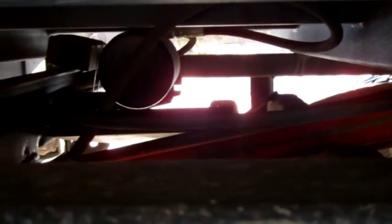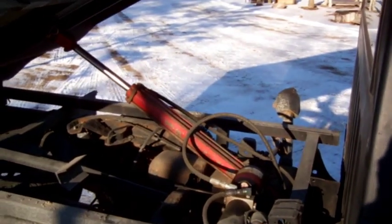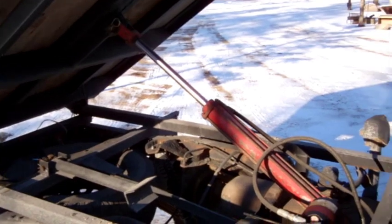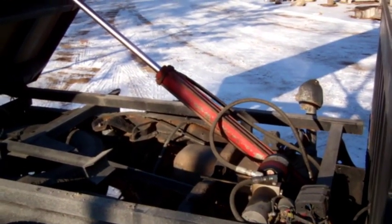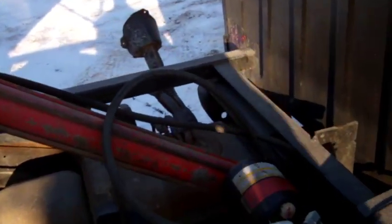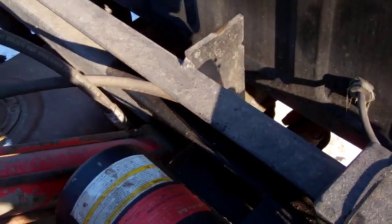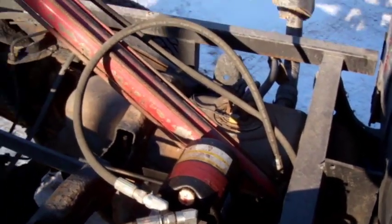This gives you an idea of the angle — the camera is about flat, and that's about the angle on my ram. It's just basic trigonometry to figure that out. With a 2-inch ram, if you want to lift more you could make the angle as steep as possible, but then you start sacrificing the dump angle when the bed is open. I didn't go with the scissor-style lift. I did a lot of looking into it, and I figured for this quarter-ton truck I have plenty of force with just the single ram — a lot less moving parts, very simple. For a small application like this, there's nothing really wrong with it. The key is to get the pivot point of the ram as low as possible in the truck, otherwise you won't get the angle, and you do need a bit longer ram. But for the amount of hassle of building a scissor, this was the best way to go.